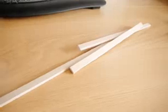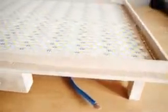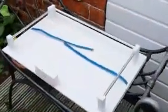Once you've confirmed that there are no loose connections, cut some lengths of 6mm MDF to make a border about 1.5cm high around the edges of the panel, using wood glue to keep it in place. Leave a gap along the top edge so you have the option of sliding in coloured filters when it's finished — it also helps keep the LEDs cool. Now you can paint the whole panel — I chose white but you can choose any colour you like. To help reflect light off the border, I added some reflective tape along the edges, though this really doesn't do much so only bother if you happen to have some lying around. Keep in mind that you'll need to stick on some electrical tape first to prevent the reflective tape from causing any shorts.